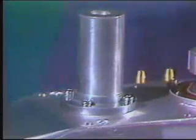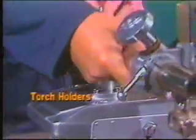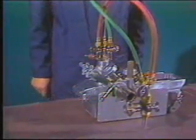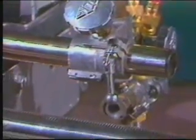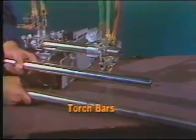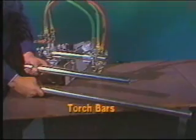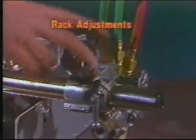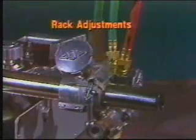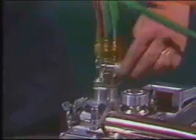The design of the horizontal and vertical torch holders makes the IK-12 MAX highly adaptable and very easy to use. It can accommodate torch bars up to 100 inches long for multiple torch stripping or reaching into hard-to-get-at spots. Rack adjustments make setting torch locations quick and easy, and the manifold pivots freely to minimize strain on the torch hoses.